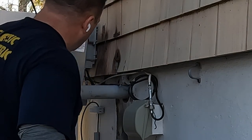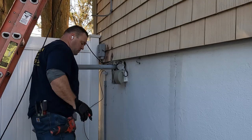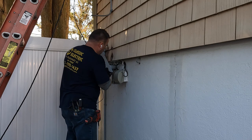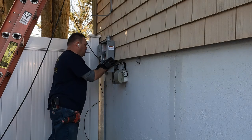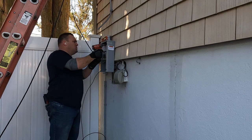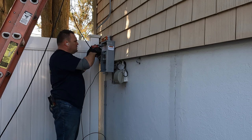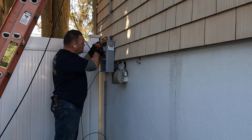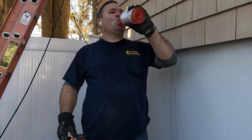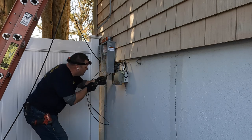Now I can put my meter right up against the side of the wall and get a good accurate measurement without even using a tape measure to cut my PVC. I'll come back with a Sawzall and cut it - the footage got cut there, I'm not sure what happened. But now we get a nice dry fit and make sure we're good on the other side where the panel is before we attach it to the house. We're using two-inch corrosion-resistant gray core screws with Phillips head drives - I think we're one of the last trades to still use Phillips head drives.